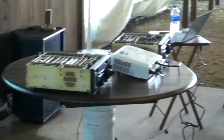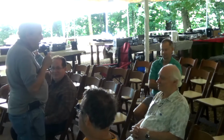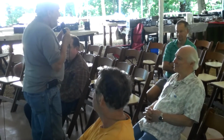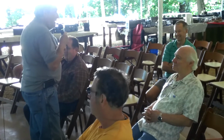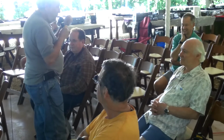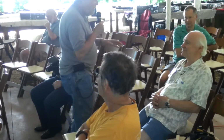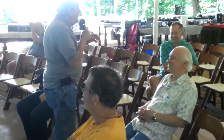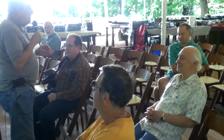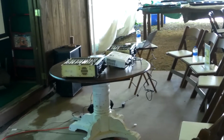George, you said you worked on TR-7s, right? What is the first thing you do when you get a TR-7 and you open up the cabinet? You pull the boards out, put a drop of DeoxIT on the pins, let them dry a little bit, put the board in, take the board out, put the board in. I'm not a broken record, I'm telling you the procedure. Put the board back in, because those things corrode. About 60% of the time, that fixes the radio.